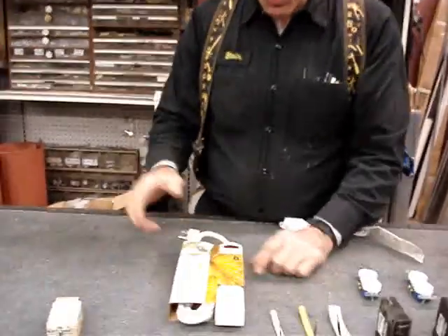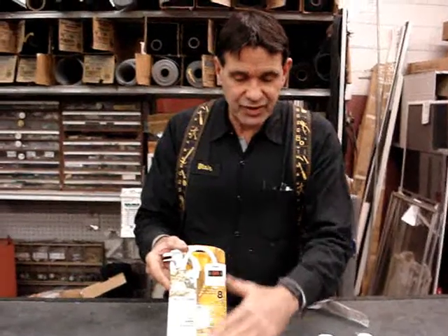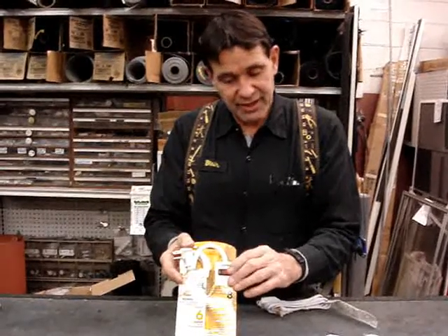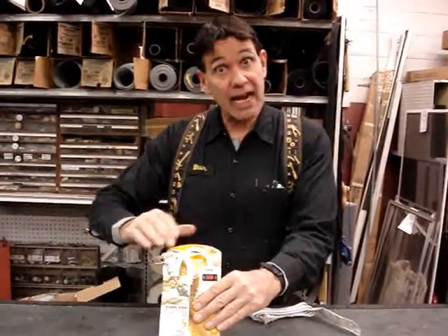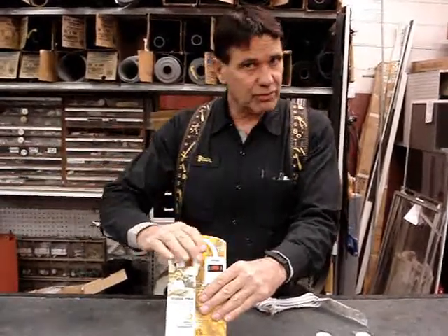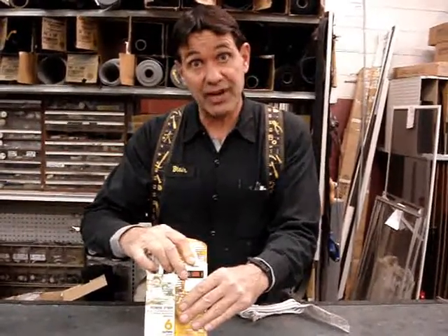Not to be confused sometimes with the power strip, which has a circuit breaker or a switch on it. Many people think that there's some protection there. This is protecting just the strip. So if you plug in more than 15 amps into this power strip and it exceeds 15 amps, this will trip. That's terrific. But when you plug it in the wall, this particular circuit could be operating your TV set, your sump pump, other stuff in your house, and this strip won't know anything about any other electricity being used. So there's some security here, but there's some false security sometimes. You have to know everything that's on a circuit when you're going to run a circuit up real high.